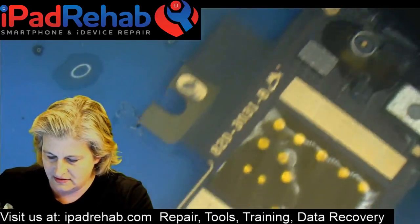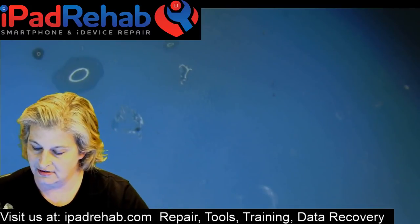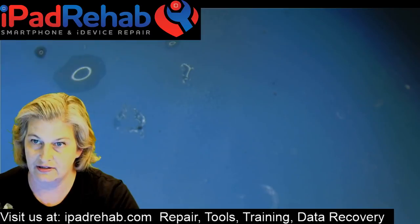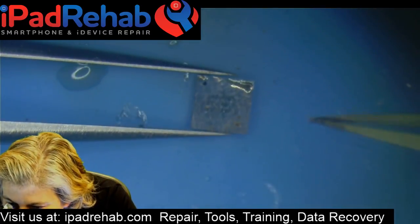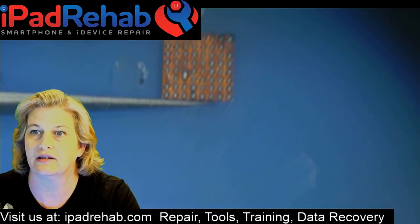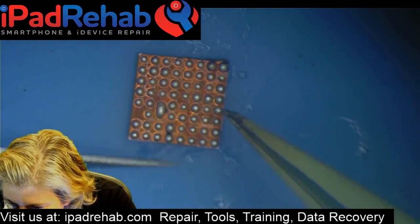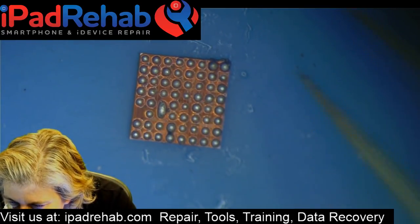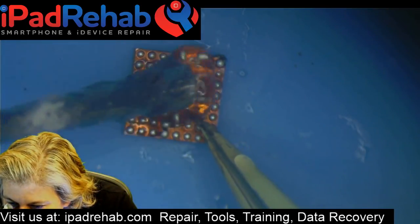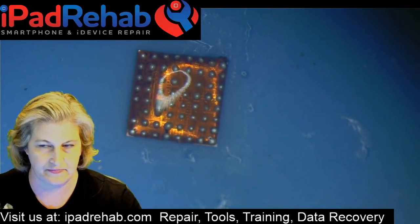All right. Now, especially if you're in the let's-try-to-avoid-soldering-at-all-costs camp, it's really tempting to say, can I just pop this chip as is right on my other board? And the answer is no. You have to re-ball it because it needs to make very even electrical contacts through all of those little connection points there. So we're going to re-ball this sucker.